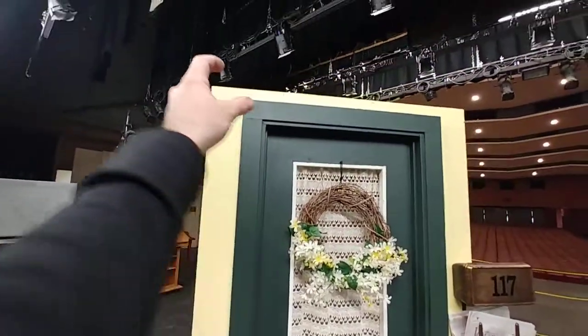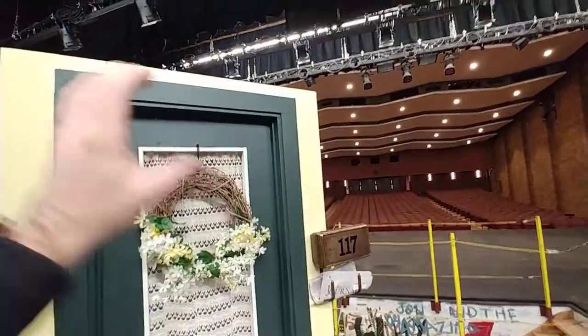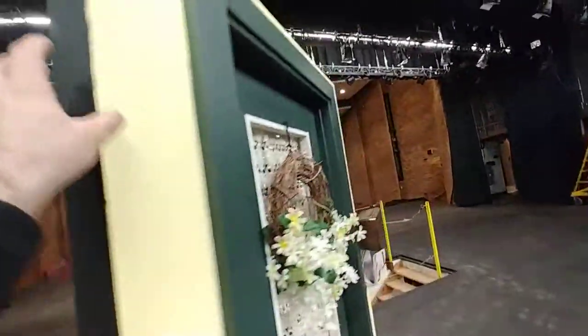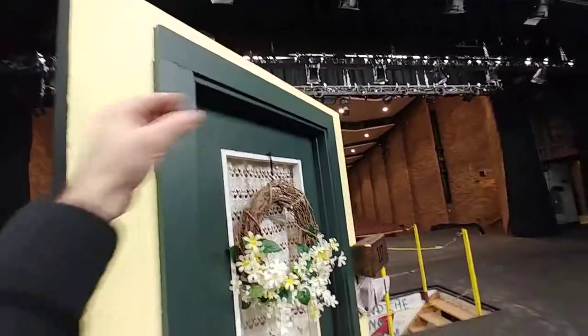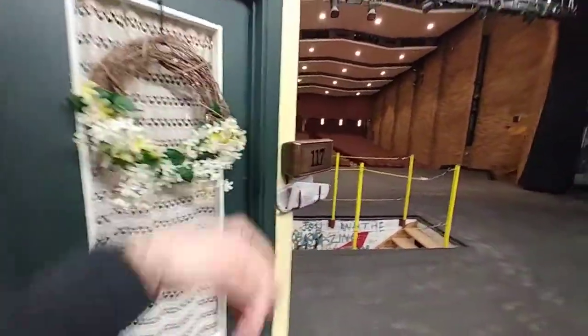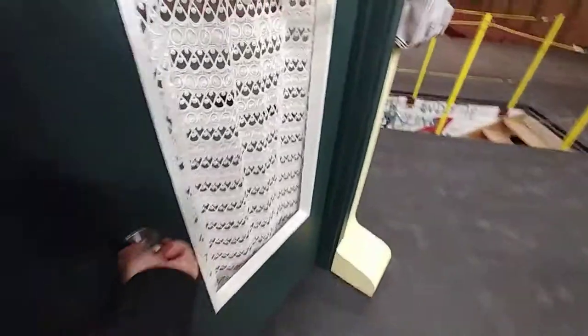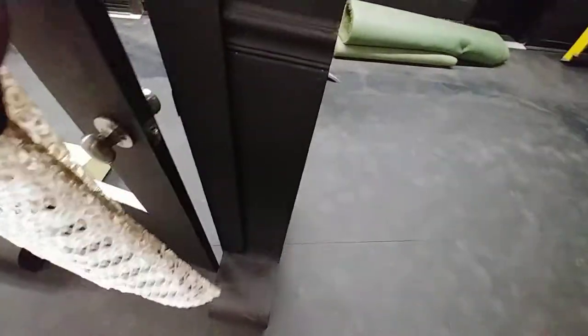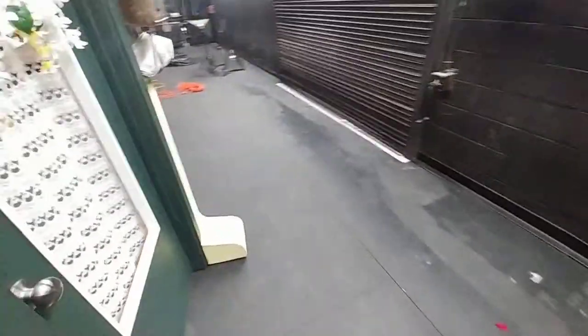We've got a ton of mileage out of these doors. If I would change something in the future, I'd get the same reveal across the top and down, which would also create a heavier box beam out of plywood. This is a three-quarter inch plywood box beam — I created the front, the back, and then put the edges in, which keeps the door opening square. There's a small gap you can see through, but improving that would give you a door frame you could take anywhere, open or closed, with no threshold.